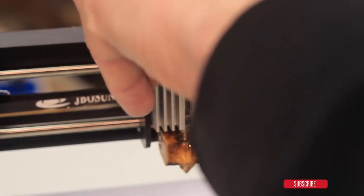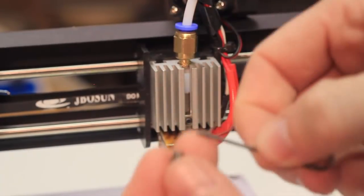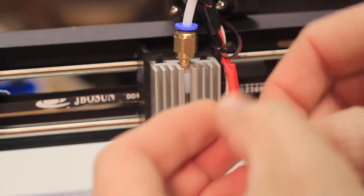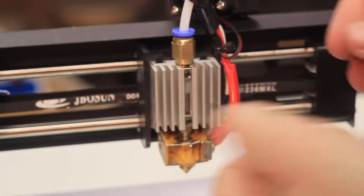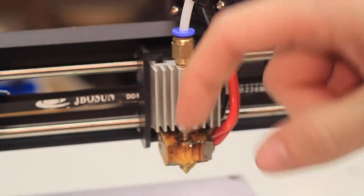Once you do that you can just put it back together. I'll do another video later on showing how to cure the problem of filament getting hot in the heat sink. You push that down, put the nut back in there — it's a little tricky. But there you go, it's all back together and ready to have filament fed in and print again.